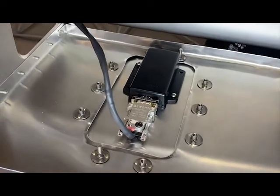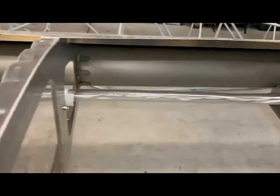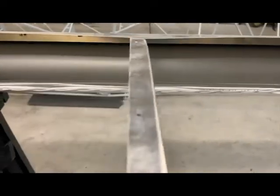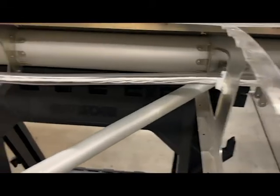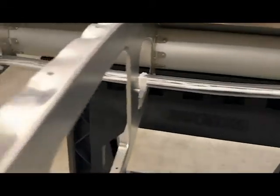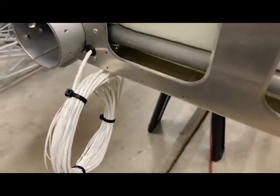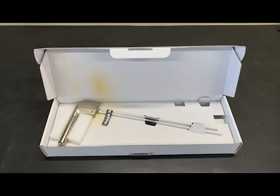The mounting plate and access cover are all mounted with non-magnetic stainless steel hardware. I routed the wires through a clear tube conduit secured to each rib. Inside is the shielded CAN bus wire, the twisted power and ground wires, and a couple of lacing cords running the full length. Those cords are routed in the conduit in case I need in the future to pull more wires through after the skin is in place — they don't add any weight, and it's easy to add them now.